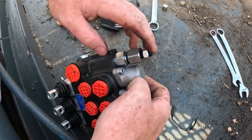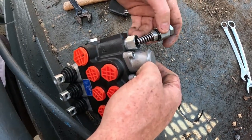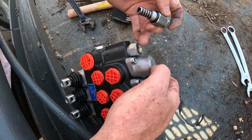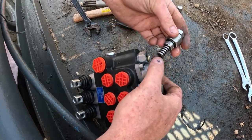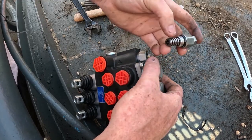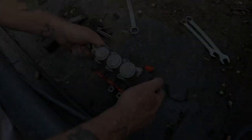I just undone that quickly — I'm going to show you what's inside there. That is your release valve. What happens is as the pressure comes in through the pressure side, when the pressure gets too high this spring is compressed and it squashes, and when it does that it lets the oil past it and it goes across. It's basically made up of a little plunger and a spring — there's nothing technical about that really.